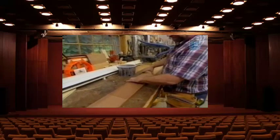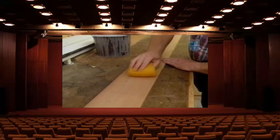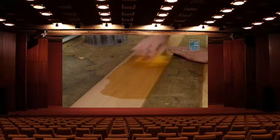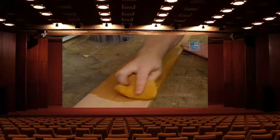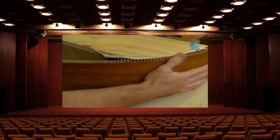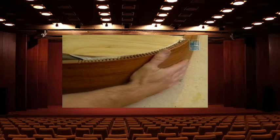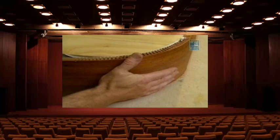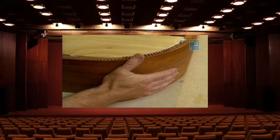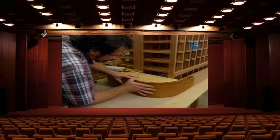There's another piece with all the kerf cuts made, and this time I'm going to try everything. I'm going to put a little bit of water on the face side — maybe that'll make the wood a little more supple and it'll bend around that corner. Here we go on the second attempt. I find that if you sort of work it as you come around, sometimes that helps. I think we've got success on this corner — now a couple of nails to secure it in place.